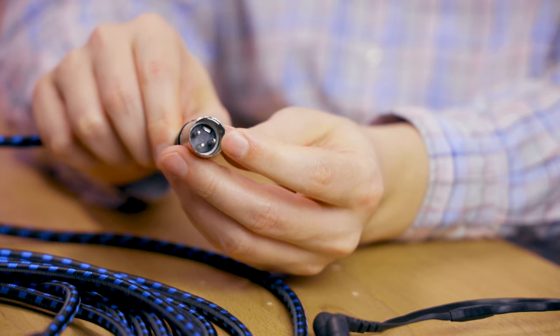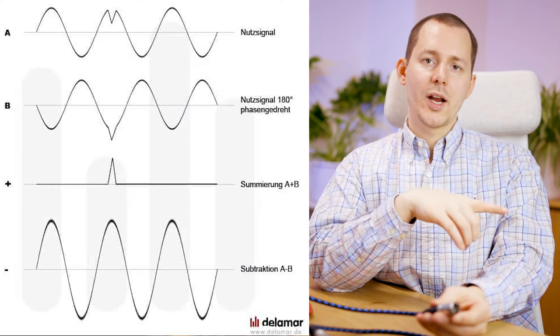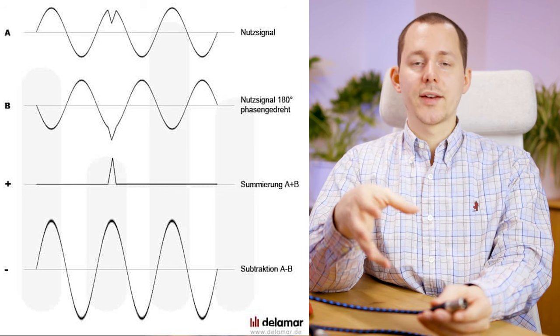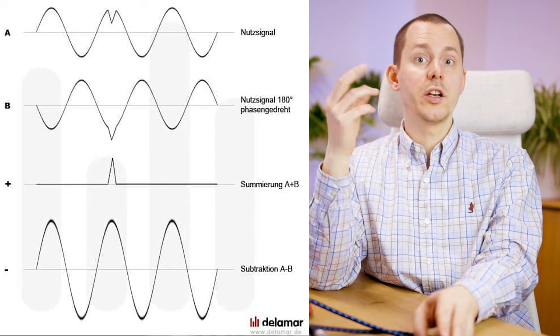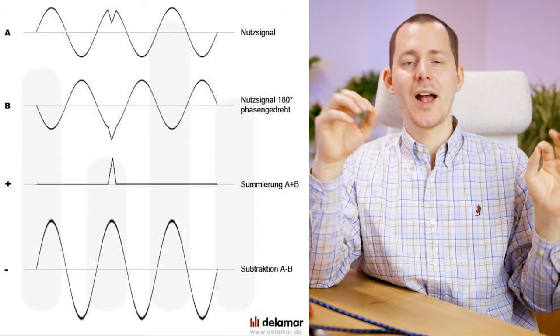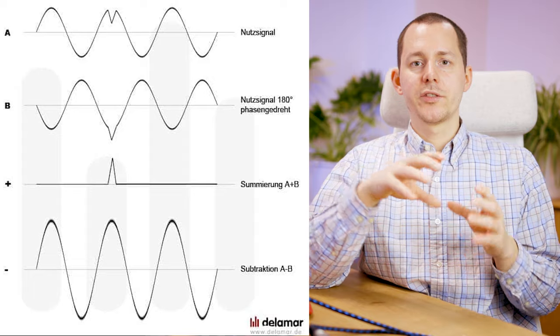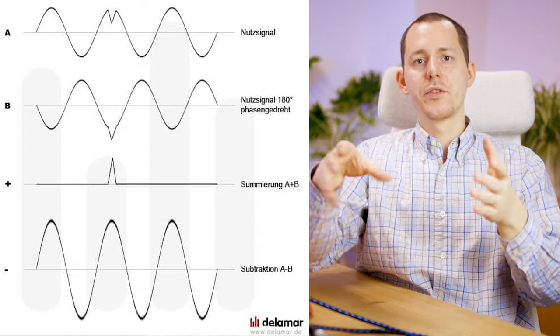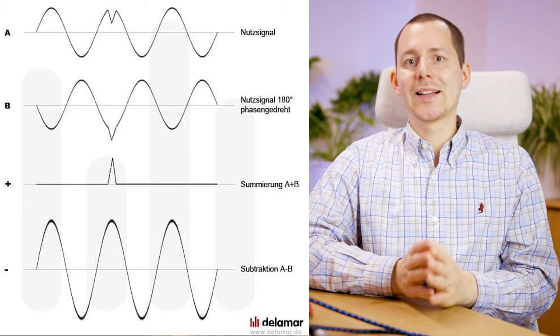In the case of a balanced signal, the signal is actually sent on both of those other two connectors, so you're utilizing all three prongs inside the XLR cable. What happens is that the signal gets sent inverted on one channel and in its original form on the second one. The reason why that is important is because on the other side, inside the audio recorder, those two information strings — those two waveforms that are inverted to each other — can actually be added up. With that, you can isolate the interference that was picked up throughout the cable and remove it, producing a clean signal on the other side. You basically split the signal in half, inverted one, sent both through the cable, then packaged them back together, doing a kind of error control to achieve a clean signal.